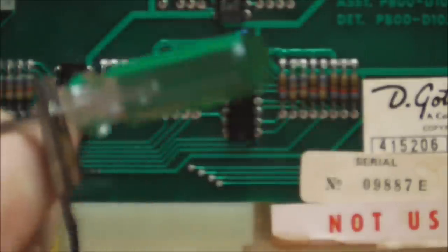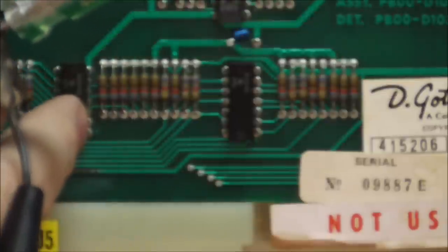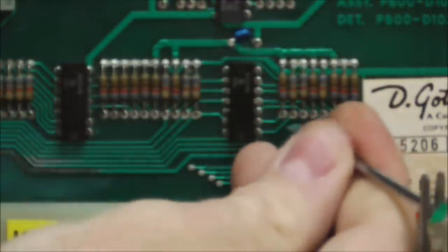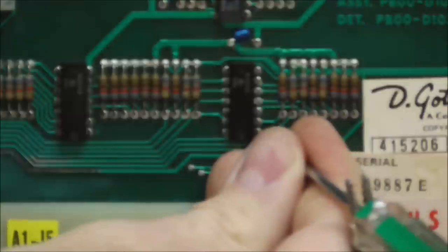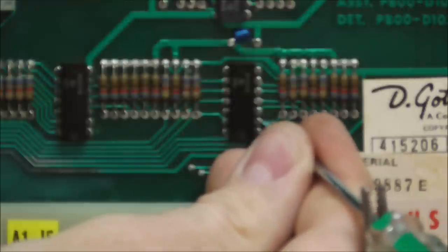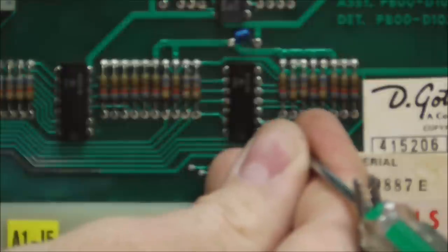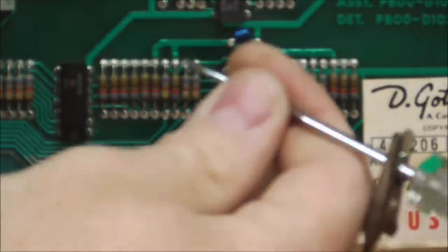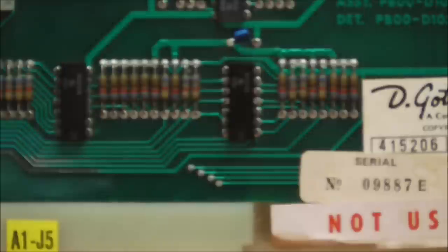Okay, so this one is the one that's all of the solenoids that we already know work. This one over here only controls two solenoids. The first one that it does is pin 1. That's one of these kickers up here, the saucer. So pin 1 and 2 make the saucer work. So 3 and 4 are my drop target reset coil.